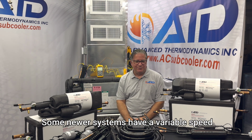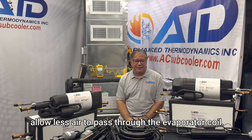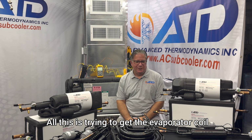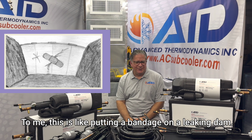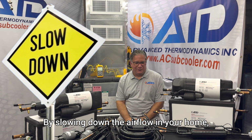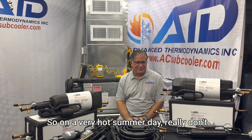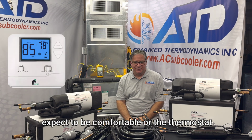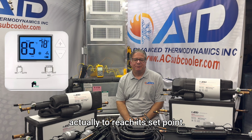Some newer systems have a variable speed blower that will slow down the air volume to allow less air to pass through the evaporator coil. All this is trying to get the evaporator coil colder so it can remove more water vapor from the air. To me, this is like putting a bandage on a leaking dam. By slowing down the airflow in your home, now it will take much longer to cool, so on a very hot summer day, really don't expect to be comfortable or the thermostat actually to reach its set point.